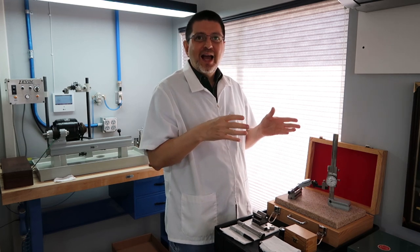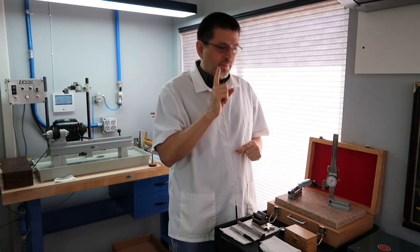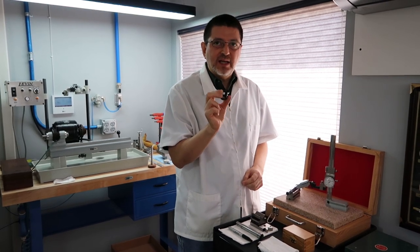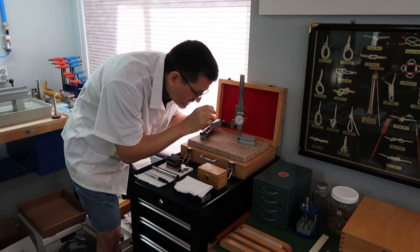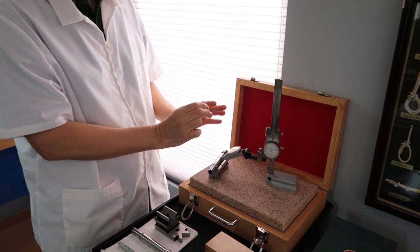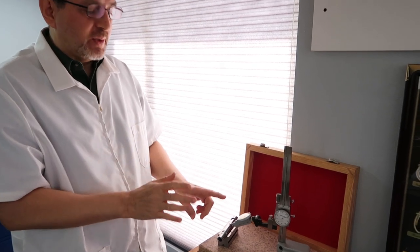Yesterday I went through all the spindles trying to find any kind of runout. And I found runout, well, I should say I found detectable runout on one headstock spindle. It was so difficult. I actually had to use my 10 power loupe, looking at the needle and slowly turning the spindle, to find the high spot. Probably due to my age, I had to really focus to detect the movement. But it's so minimal, it's ridiculous.